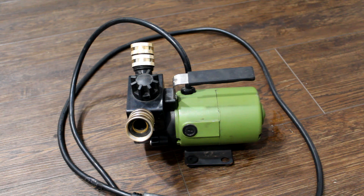The pump kit comes with a reinforced suction hose and a strainer. The strainer is used for drawing water from spills on a flat surface — if your basement floods, that strainer will create a vacuum over the flat surface and draw water from it. The suction hose has a braided wire inside that prevents the hose from collapsing on the suction side, keeping your hose open and the flow unrestricted.